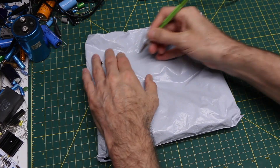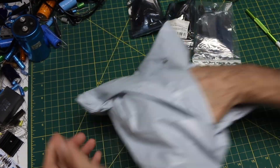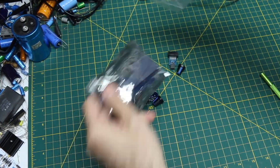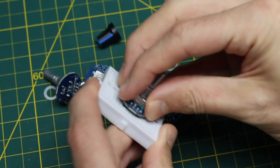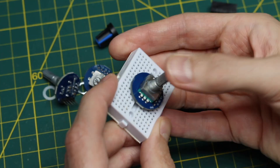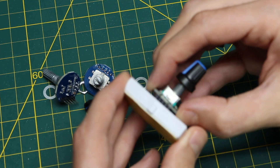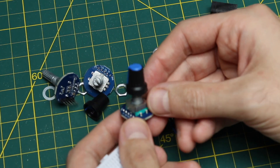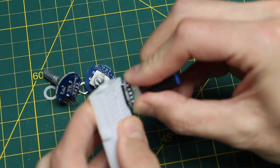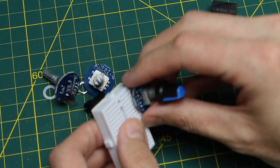I need some more parts so it's a good time to dig into the mail queue. Each of these are two pieces: rotary encoder and USB ISP AVR programmer. These are just standard breadboard-friendly pin header boards for a rotary encoder with the push button. For quick access I have some standalone encoders that need to go into a PCB, but for breadboarding — if I wanted to quickly get some Arduino thing running with a display — I wanted some of these on hand.